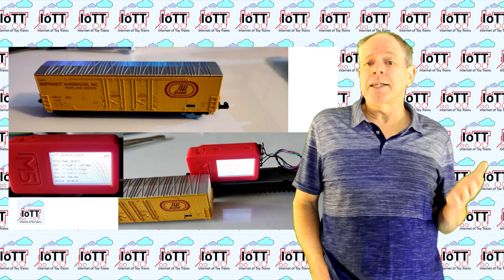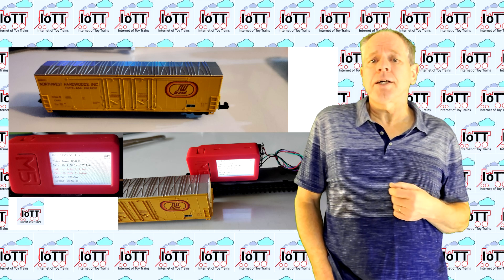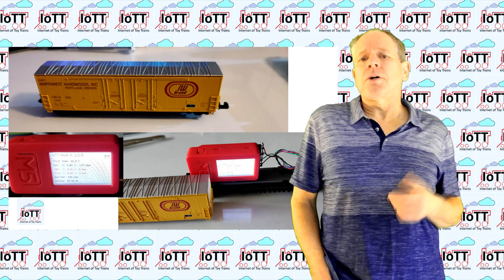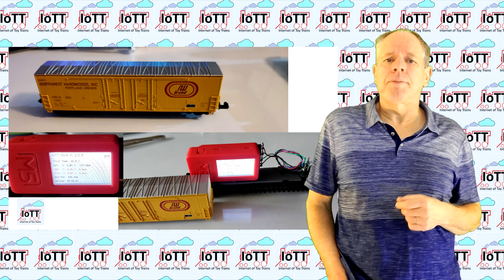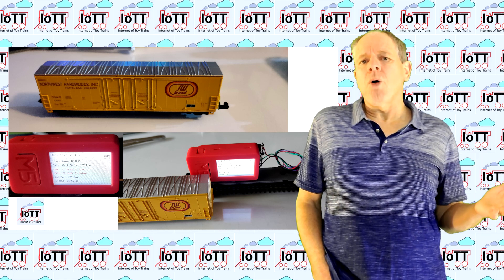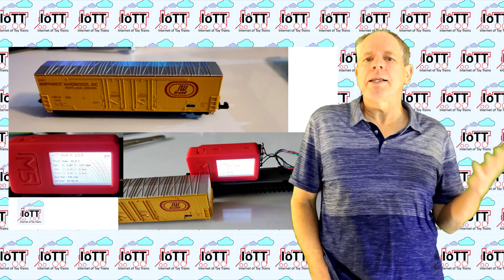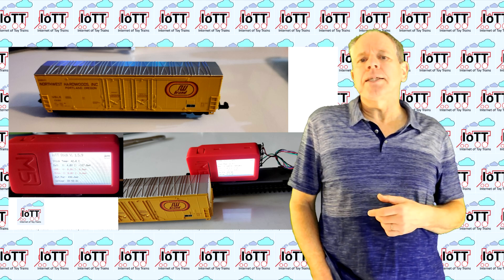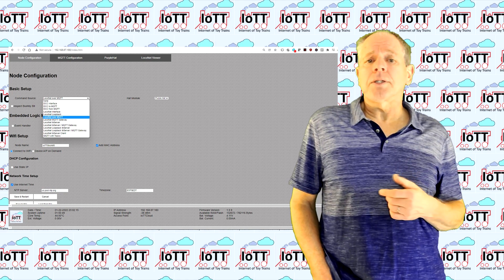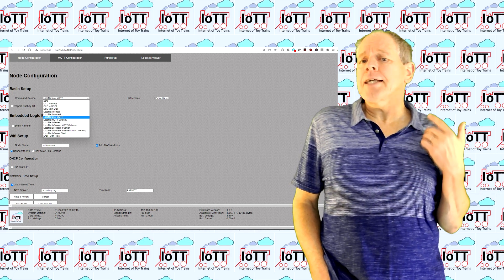For the N-scale version, I have selected this freight car to create what I believe is the world's first N-scale track measuring car — at least my research so far has not produced any hints for a similar product. But if you are aware of such a car, please let me know in the comment section. I am currently designing a PCB that also will allow for an easy conversion. The plan is to cut open one side wall and install the PCB and IoT T-stick in a way that it is possible to read the display while the car is traveling. And of course, it can be connected to Wi-Fi so that you can conveniently read all the data on a PC screen or in the browser of your cell phone. I am currently working on that software and might be able to show something in the next video, so stay tuned.